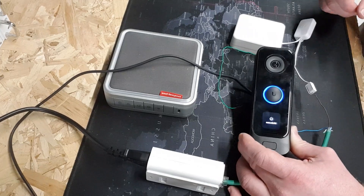So there we go — a quick revisit over an existing video. Hopefully this will help a few people out, especially if you're looking at getting the G4 or the G4 Pro doorbell. This is unofficially a way to power your G4 via PoE — you can use a PoE injector, or you can get the 48V to 24V dropper adapters that sit in line if you wish to power this from a PoE switch. That gives you the added advantage that if it's at a remote site you're looking after, you can reboot the doorbell remotely by just turning PoE off to the port it's plugged into.